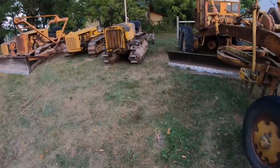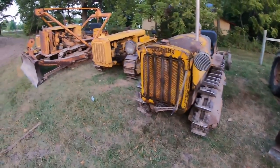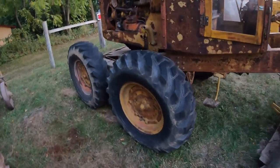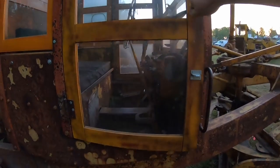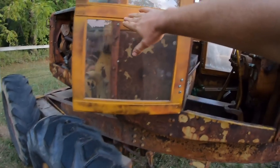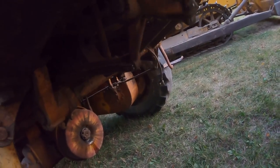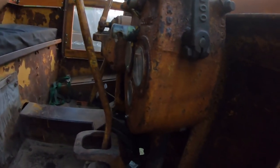To finish up yesterday, we got the D4 pinion latches adjusted, I think two days ago now already, and then ended up working on the 11 grader last night. I left the camera off, but Diesel and Digger and John ended up in the mix before we got done. The shutoff lever had never worked on this thing. It had always been stuck, so we took this panel off of the dash and freed it up to where the linkage mechanism is at least moving down there. So later today maybe we can test that out and see if it really works.